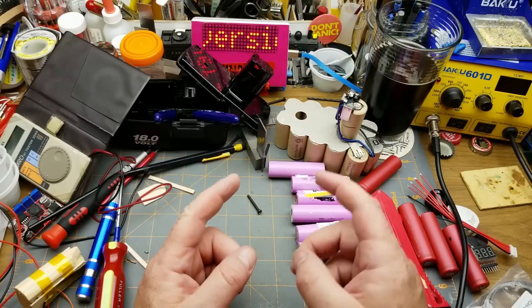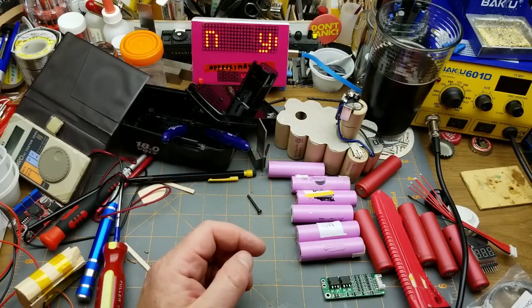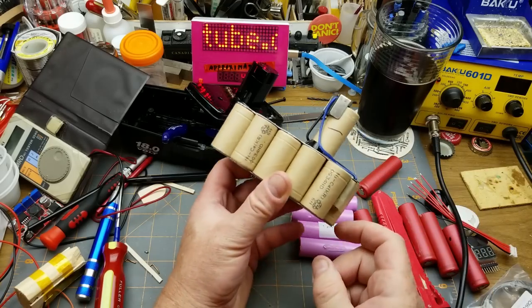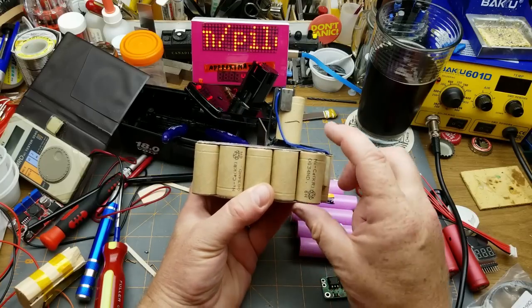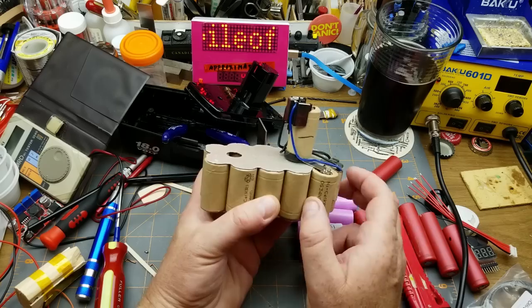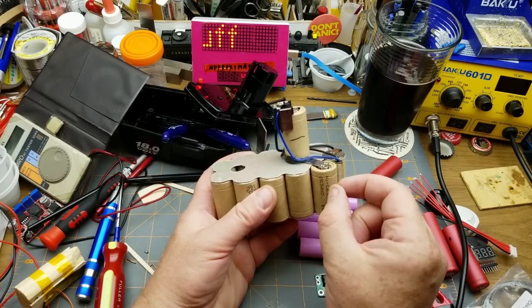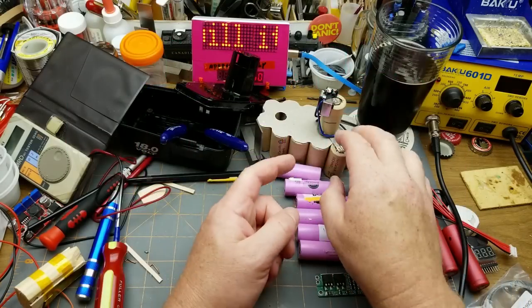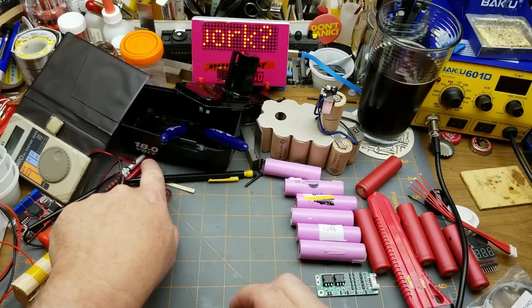In that video there's also how I took this battery apart — it's not that exciting, it's four screws and it just pops right out. Here are the stock batteries. They are NiCads of the sub-C form factor, which is basically C-size but smaller, designed specifically for building packs. This pack is an 18-volt NiCad pack.